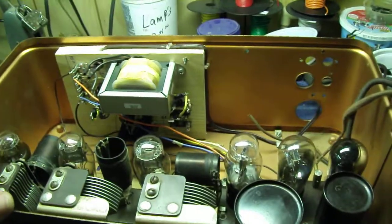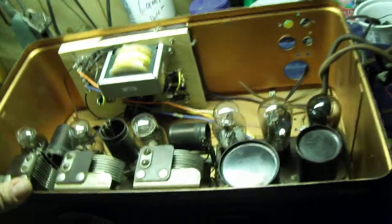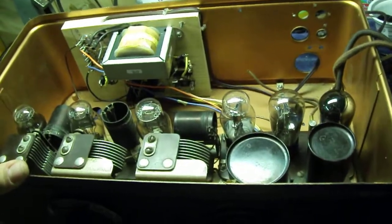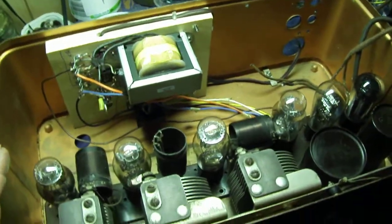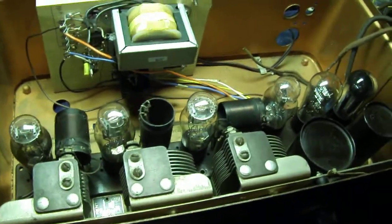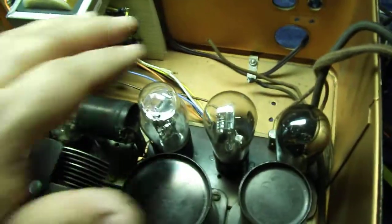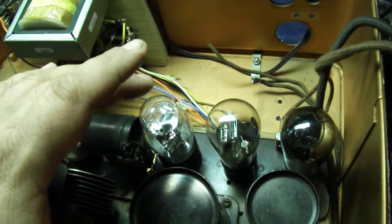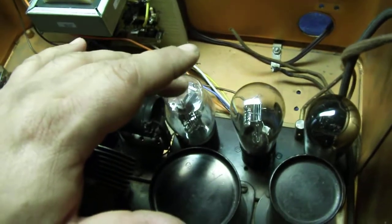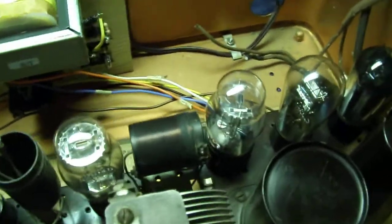It is possible to do. There are many different things you can do with these early TRF radios. People don't want to tell you or they make it hard on you — they want to play games on and on. I just got sick and tired of it, found it out for myself, and fixed it right. I'm using a 2 megohm grid leak on the 630, which works really good from the underside.